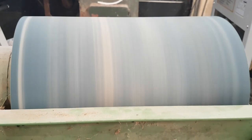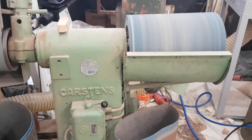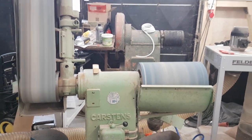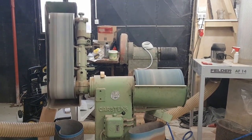The drum sanding machine is really magical when it comes to removing an incredible amount of material. When you're on very coarse grit, it is almost as fast as a planer. We use it sometimes when pieces are just bent and you can't send them anymore on the lathe, or when we have to make some special shapes. It's an incredible machine, but not for very fine sanding — with fine sanding you can easily create ripples which are then coarser than the surrounding surface. So fine sanding we do either by hand tools or by hand.